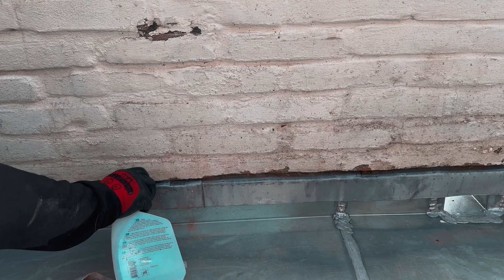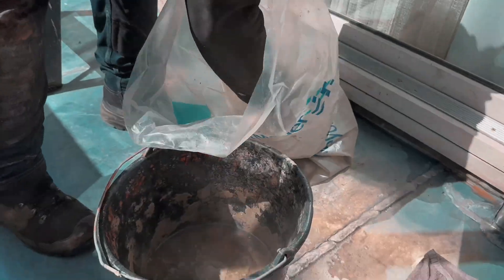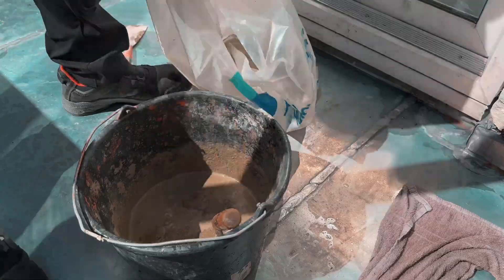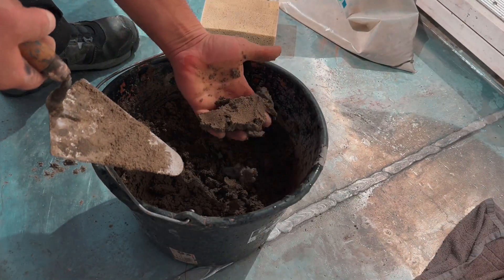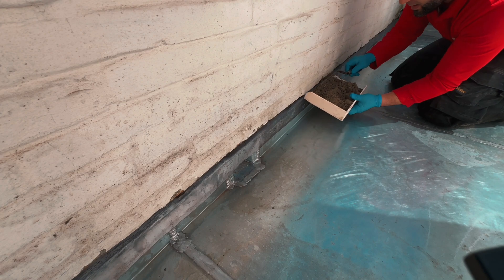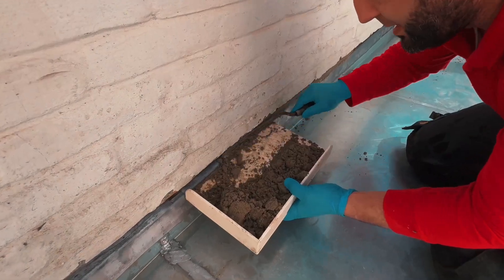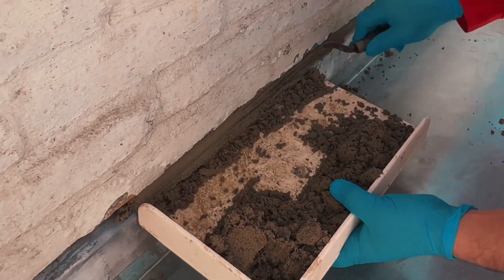Here I am rinsing the joints clean to achieve optimal adhesion. I used Cantaclara joint mortar because it keeps the workflow at pace. Don't make it too wet, but nice and firm — my wife would say it looks like couscous. I am filling up the joints, pressing really hard to get most of the air out, because that's how you get a great joint that becomes rock hard.